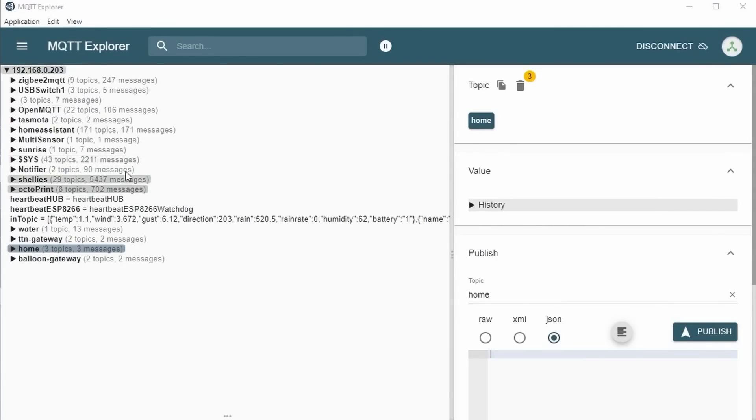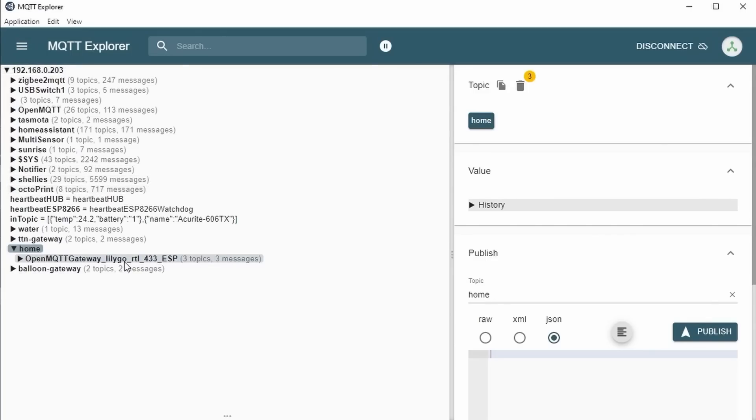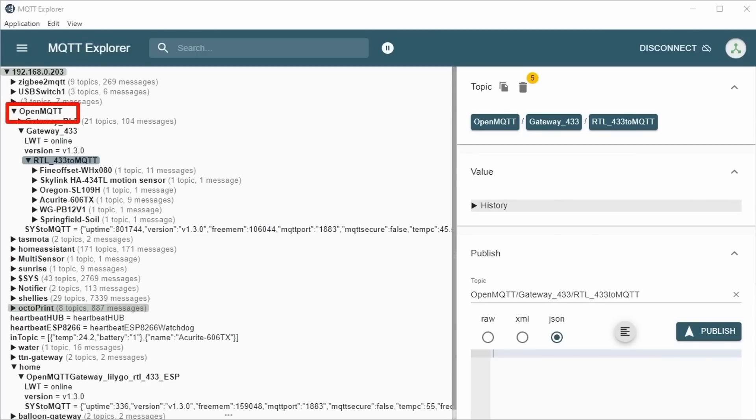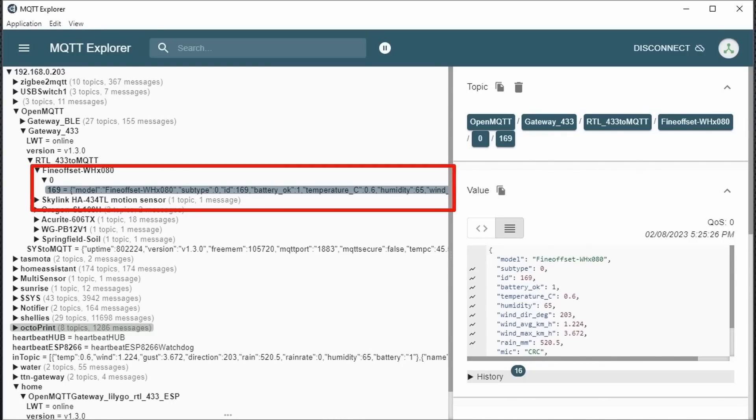My favorite tool to debug MQTT is the MQTT Explorer. Connected to your MQTT broker, it shows its traffic in an organized way. If we do not change the MQTT topic of our device, we should see messages coming with the topic Home/OpenMQTTGateway/Lilygo-RTL433-ESP. I changed the main topic to 'OpenMQTT' because 'Home' is too generic for me. If you have any supported 433 MHz sensors around your device, you automatically should see their messages in JSON format. Even my weather station on my roof delivers all its values without any problems, and because we live in a crowded place, we also get sensor data from our neighbors. Maybe you only need to build such a gateway and can save the money for a sensor!